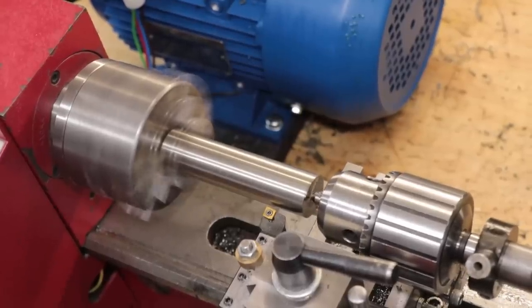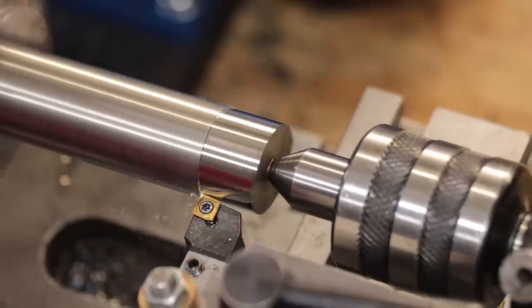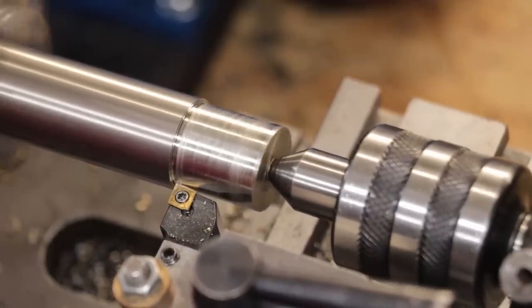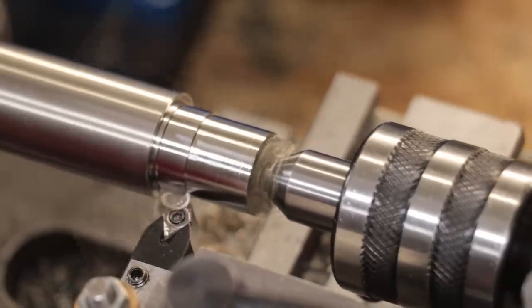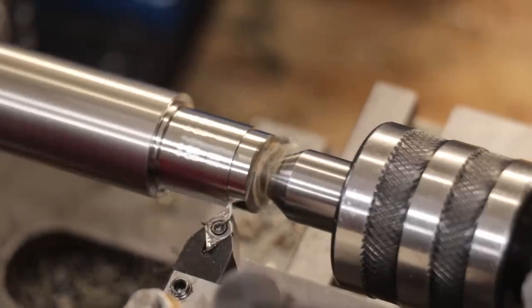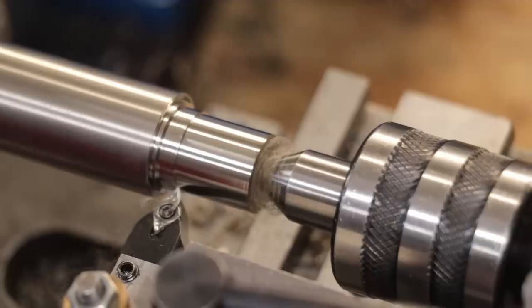Let's try some stainless. What I have here is 316 stainless, which is pretty much all my metal supplier sells. 316 stainless has always been a bit of a problem to machine with my setup — it's just a really tough material and it can work harden. The first passes were pretty tough; it seemed to be rubbing quite a bit and just ripping the material instead of cutting it. I don't have any inserts specifically made for cutting stainless, so I switched over to a very high rake insert made for cutting aluminium. I'm pretty happy with those results — I'm not breaking a chip, but I'm getting a really good surface finish.